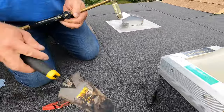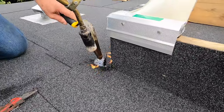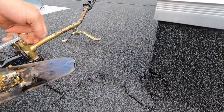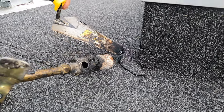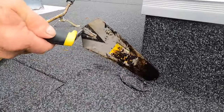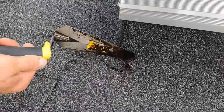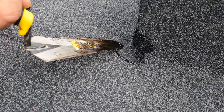You take that piece, and to make it a good seal, you just put a little bit of heat to it, like that. And I seal the bottom, the top, around the corner. Heat this up, just like that. Now this technique is from torch-down, and they don't show this for self-adhered peel and stick, but that way you secure that hole is closed, and by really making it tight like that. See that? That's tight now. No, it cannot leak there. Okay, that's one way.